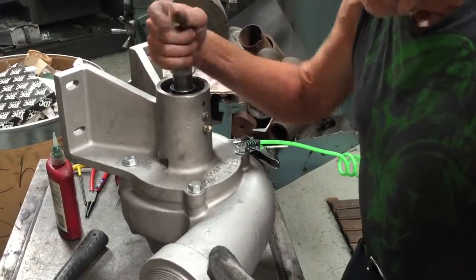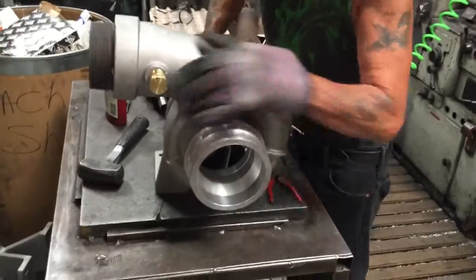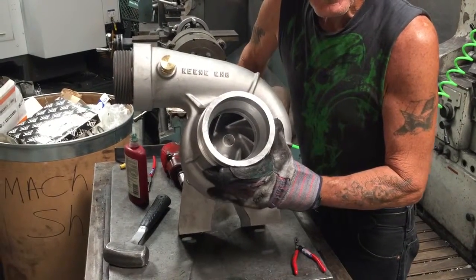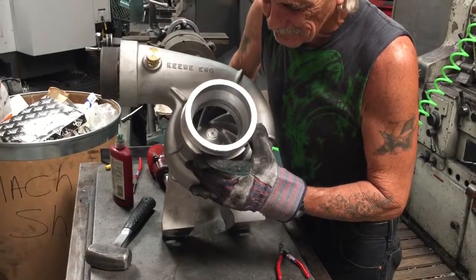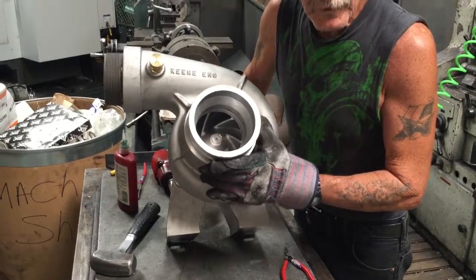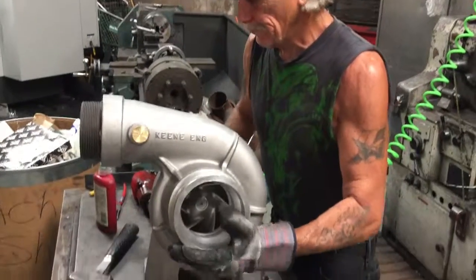Take the shaft — if you've done the pre-assembly right it will turn nice and smooth. Changing a pump seal on an average pump is about 20 to 30 minutes, about a half hour. The biggest problem is getting the impeller off due to oxidation. If they've worn their impeller out from sand, a new seal won't close the gap — they'll just need a new impeller.